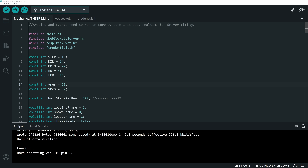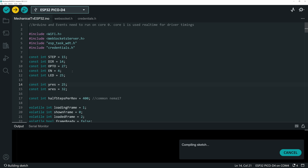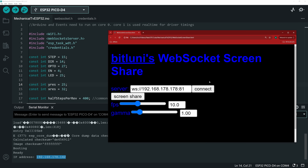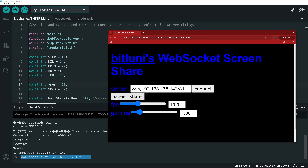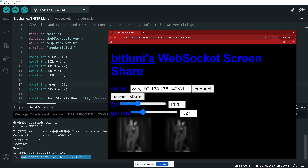The firmware of the microcontroller runs from the Arduino IDE. We just need the WiFi credentials in this file and upload it. The microcontroller connects to WiFi and starts a WebSocket server that receives the image. An HTML file connects to this WebSocket and allows you to share your screen or application — converting the image to the right format and sending it over WebSockets to our mechanical TV.